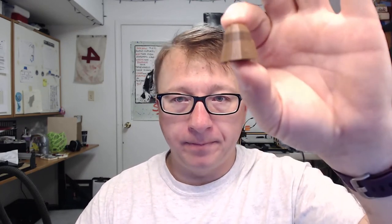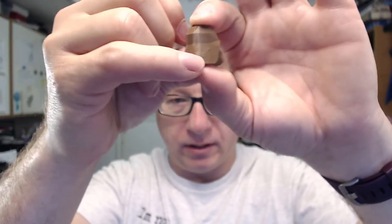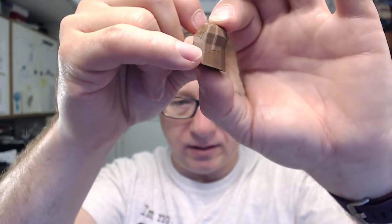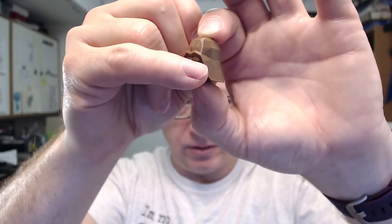This is the same black that I printed the cube in. I actually printed this before I printed the cube with the same settings. I reproduced this in the brown but not in the black. So this is printed on the CR-10 with coast and wipe on. You can see right off the bat there's that little issue, and one little zit to the side. This artifact here seems to be consistent, but otherwise nice straight smooth lines. Coast and wipe on was that one.